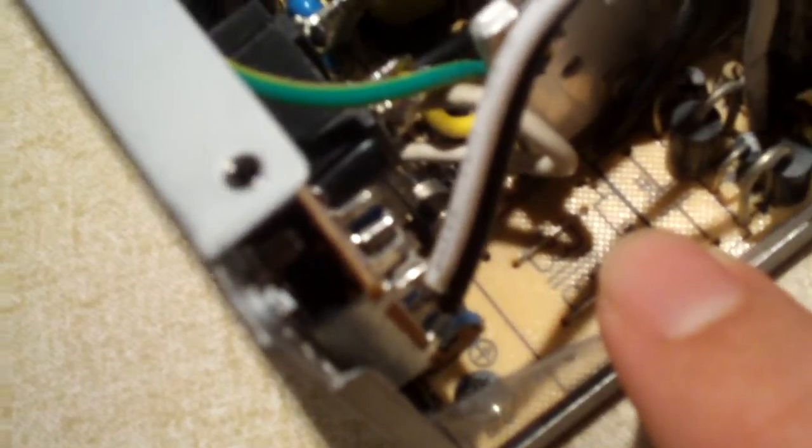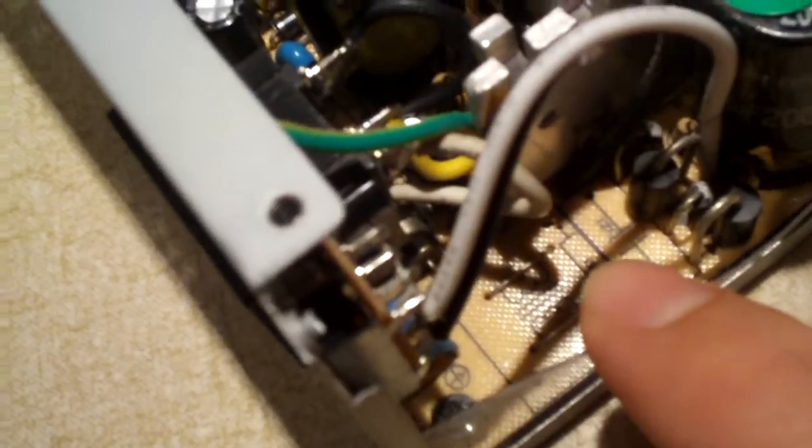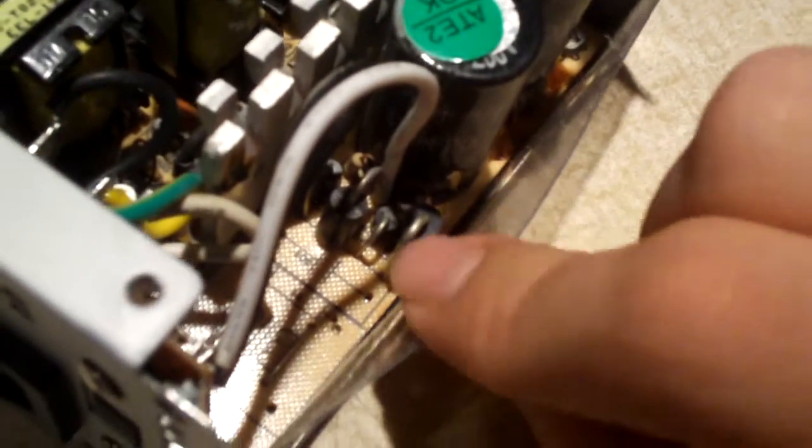Now this power supply has two Y capacitors. Yeah, you remember how it just said built in EMI filter? Yeah, that's our EMI filter. Those two Y caps. That is incomplete. Not a very good EMI filter there. Of course, we have the four-diode treatment for rectification, where we could have a bridge rectifier. There's also a place where an X capacitor could have gotten installed.